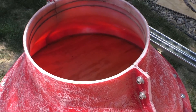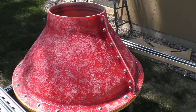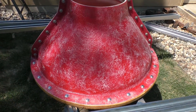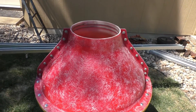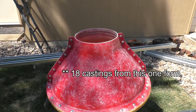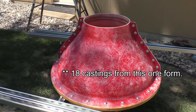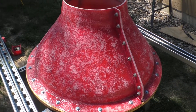The footer form is finally finished. The flanges have been trimmed down and bolted together. I glued two pieces of plywood together for the base and bolted the perimeter of the form into the plywood so it has a bottom to it. All that has to be done is put some rebar inside of it to reinforce it and fill it with cement. So all we've got to do is make like 18 of these things, so it'll get its use. Thank you for watching and thank you for subscribing — keep tuned, there's a lot more to come.